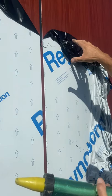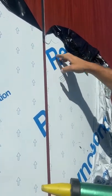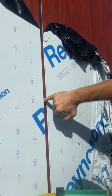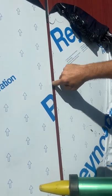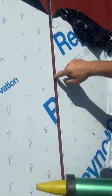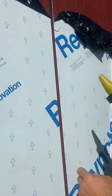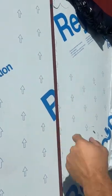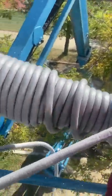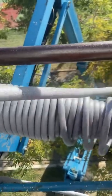We're using this peel-and-stick material as tape, so we don't have to tape it separately. As you can see, we already peeled the interior inside of the channel where the caulking goes. In this case we have a not-very-wide gap, so we don't put backer rod. But if you have a big gap, you have to use a backer rod like this, so you don't use too much caulking or too much silicone.